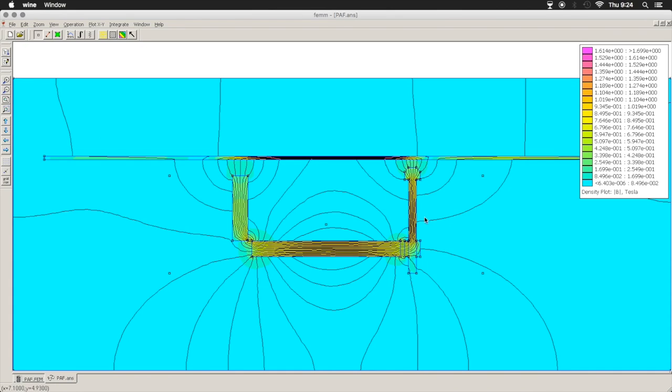How saturated the one core is related to the other, the relative strength of the two magnetic fields. Our humbucking effect is because of common mode cancellation between the two coils. So the more even they are and the more tightly the flux is coupled between the two, the more complete our common mode rejection is going to be, which means less hum in the end, but we can tinker around with the sound more if we imbalance them slightly, and we can play around with that.